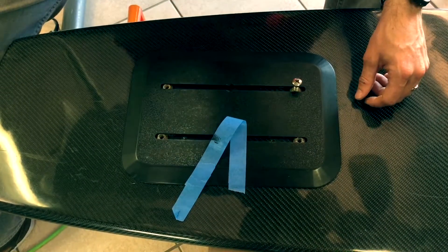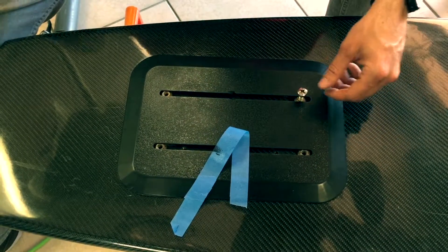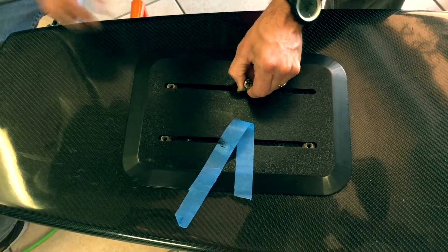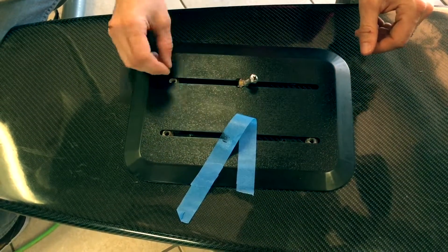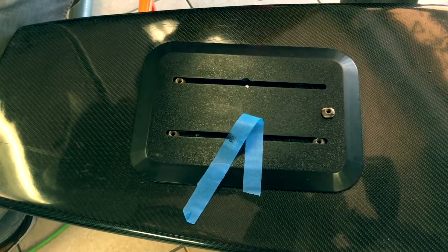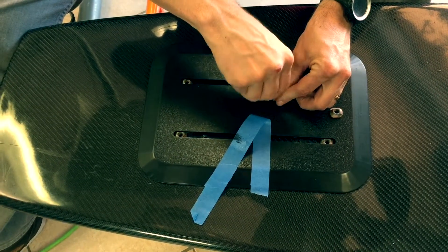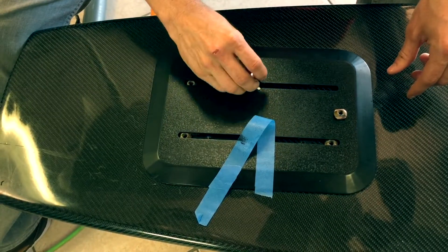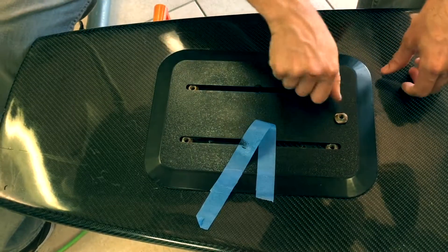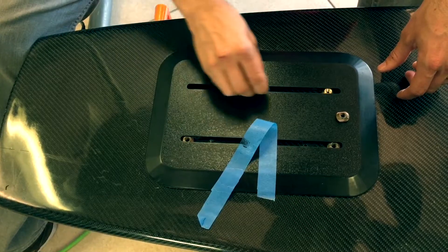We have one done. You may have to widen the grooves a little bit with that eighth inch bit to get it out. The old T-nut should slide right out like this — use the bolt to kind of slide them out. One T-nut's out. We're going to put a brand new one in by putting it on the bolt and then just slide it into the new hole like so, and we're all set.